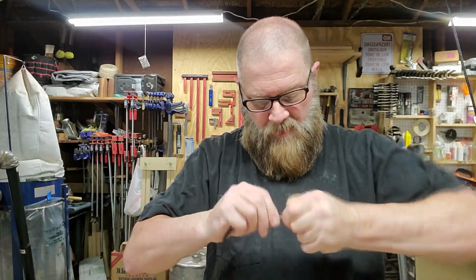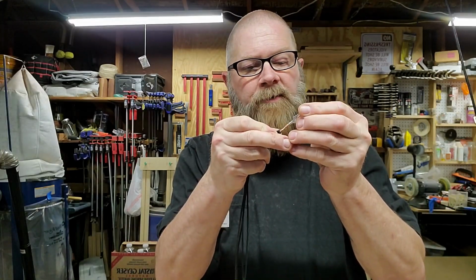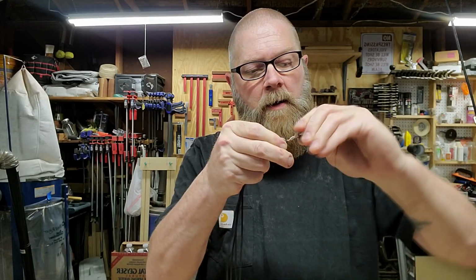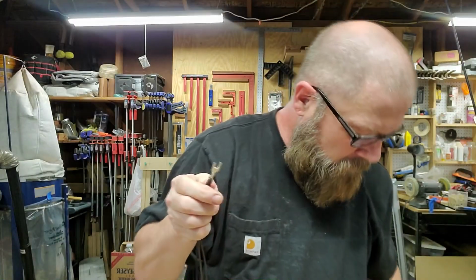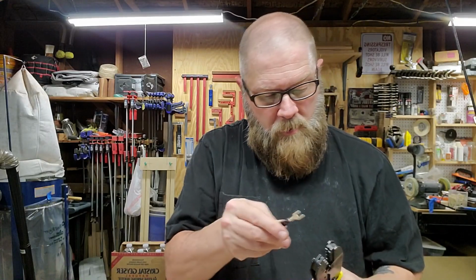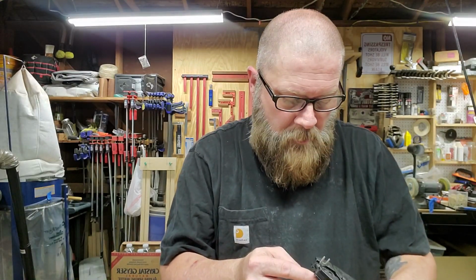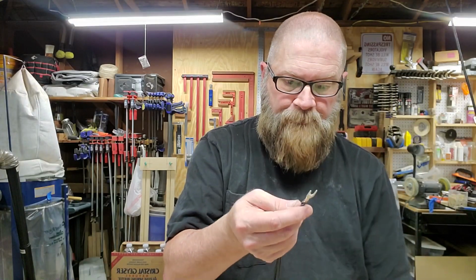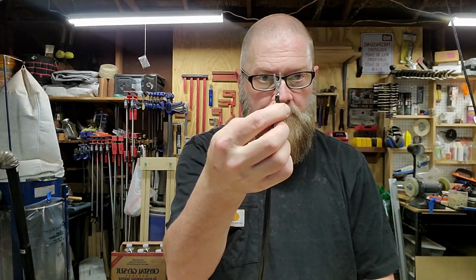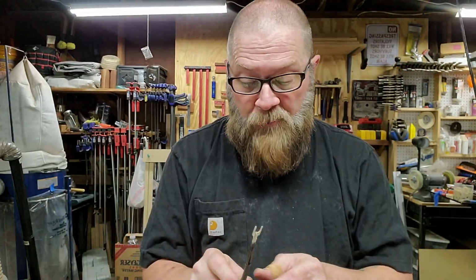So now we'll straighten up our thing there. Get that through the hole. Make sure I got enough sticking out, because remember, I want to solder here after I crimp it. So go ahead and get our crimpers out, and we'll use the smallest setting here. Get that crimped. And now we just solder and move on to the next one. See you soon.